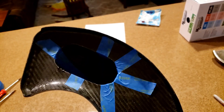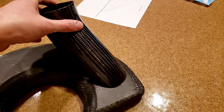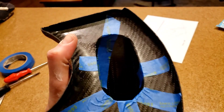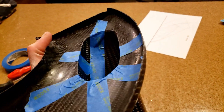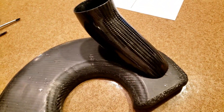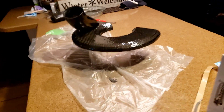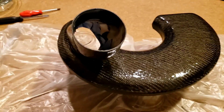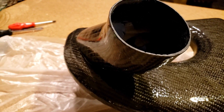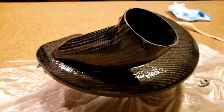I got it cut out and held on with some masking tape. I'm going to work up some epoxy — a regular standard temperature epoxy — and bond it, leaving the masking tape on the back to lock it into place. Once that's set, I'm going to use carbon fiber tape and vacuum bag reinforcement tape about one inch wide all around the surface to bond the two pieces. I just want it nice and stable, so the quick-set epoxy with masking tape will get it locked in. I put a coat of epoxy on it — we'll let this cure overnight and then it'll need some wet sanding, but this should give us a good temporary bond between the tube and the plate.